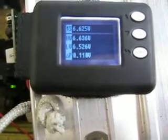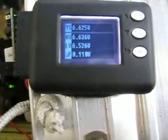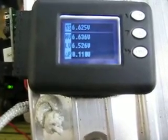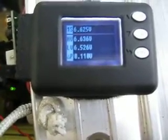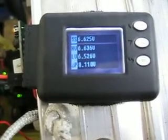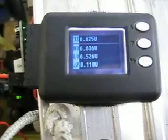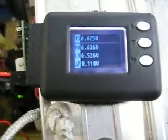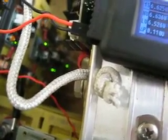Under the highest loads — maybe 450 amps theoretical maximum, though I don't know if it's seeing that high — so we'll say between 300 to 400 amps, the drop in voltage is about from 3.2 down to 2.8 volts per cell. It'll go lower than that as the batteries are drained, but 2.8 volts is when the batteries are pretty full.